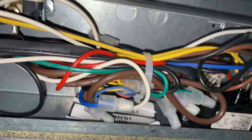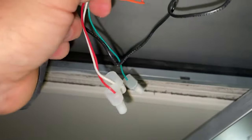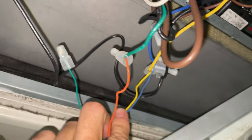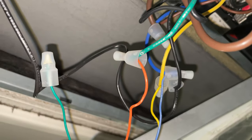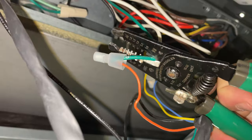I'm going to follow the wire from the blower motor into this junction box held together by a zip tie. We want to get rid of that. The low voltage wires wrapped here — orange, blue, and yellow — are the ones hooked up: yellow to yellow, blue to blue, orange to green. Best to take a picture so you can wire it just how it was, since this was a working system, or you can cut and leave the wire so you know which one goes where — which is what I'm going to do.